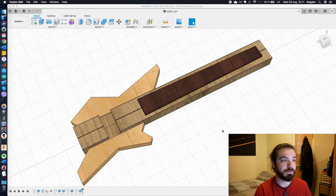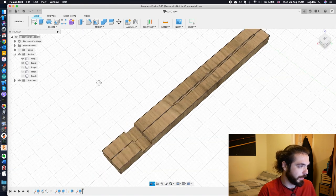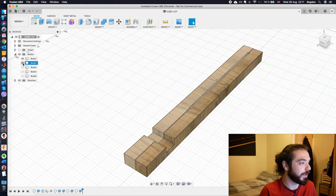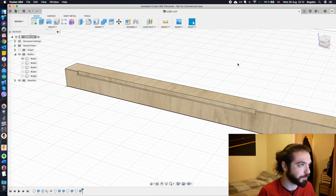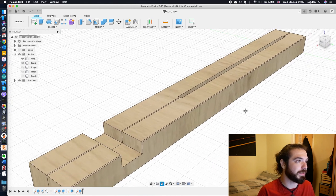The headless design means I don't have to stick to the traditional tuners you usually have on guitars, which means I can make my own tuners so much easier. Now let's take a closer look at the neck and the truss rod. If I were to get one solid piece of wood I would have had to route the truss rod channel myself, which is very difficult because I don't have a router. Instead, I'm using two smaller pieces of wood — actually oak balusters from B&Q for around 12 pounds each. I chisel out a half-channel in each of them, and after gluing them up I end up with a full truss rod channel with much less effort.